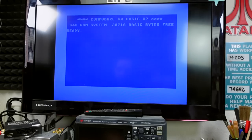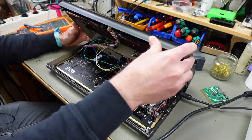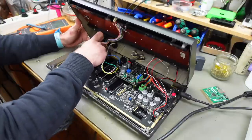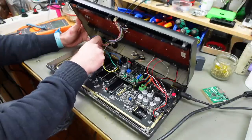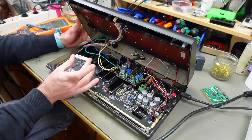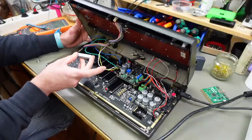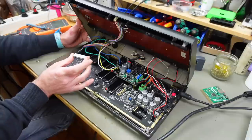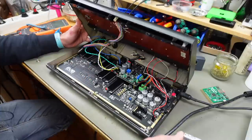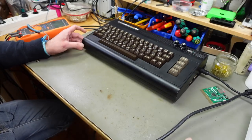We are going to make our own EPROM, I think. So we are going to extract the EPROM physically, and I think I want to extract it digitally as well and just replace that one cartridge image on here basically. So I have a new 27C801 EPROM, which this also is, and we're going to burn our own EPROM for this machine, hopefully with a startable synth card on there.